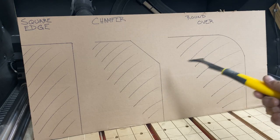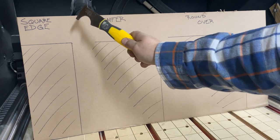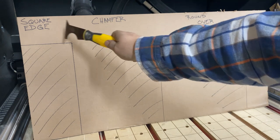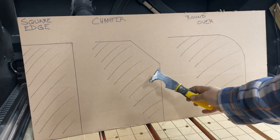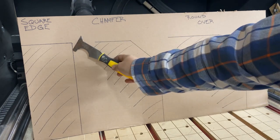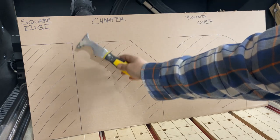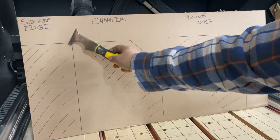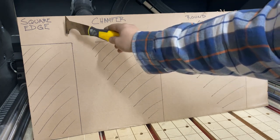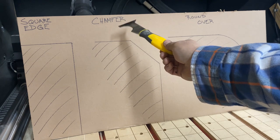I've come up with this drawing here — I've spent hours and hours on it. An incredibly close-up view should help explain my point a little bit better. This object on the left is just your standard square edge with a 90-degree corner. If something comes in and hits that corner it's going to dig in, because there's no support behind it. That corner is either going to chip off, or the fibers along the top of your project are going to start to peel and chip up — it'll look rough and gnarly.